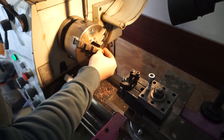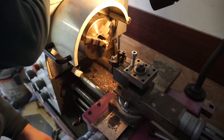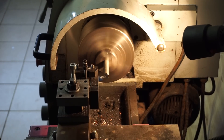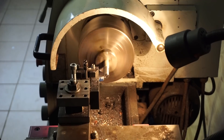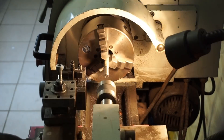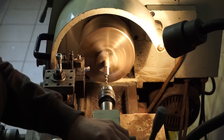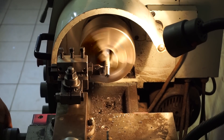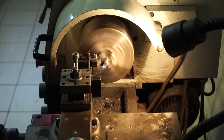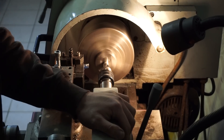The gas pipe itself is made from a copper pipe which I prepared for soldering with a gas fitting. At the end of this assembly I needed a nozzle. I've seen people using MIG contact nozzles for this purpose, but I made my own by turning a press-fit plug with a small hole in the center. On the back side of the nozzle I drilled a 6mm counter bore which does not go all the way through the material. After parting the nozzle off the stock I drilled the front of the nozzle with a 1mm drill through to the counter bore. And that's it for the nozzle.